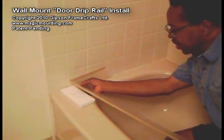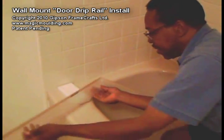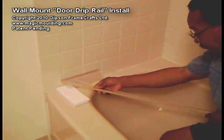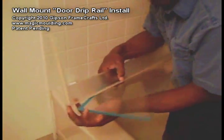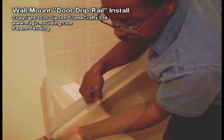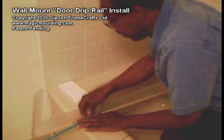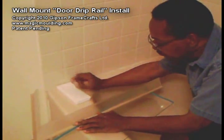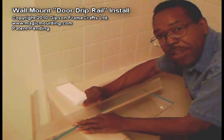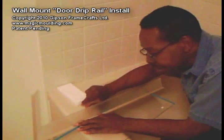If this were against the wall, when the door opens it'll still drain everything to the tub. If you decide you want to swing the door in, you have ample space to do that as well. Where we bent this, we're going to take that beyond the edge by about a quarter of an inch, because usually there's a half-inch gap between the glass and the wall, and a half-inch gap between the glass and the top of the tub or pan.